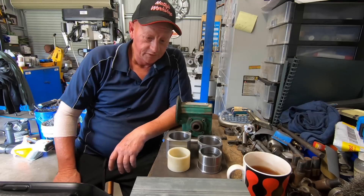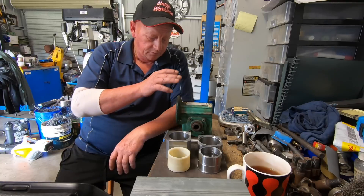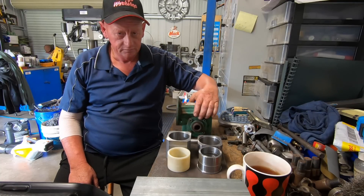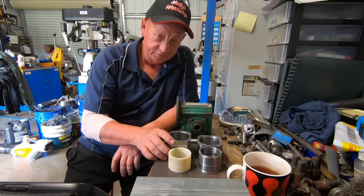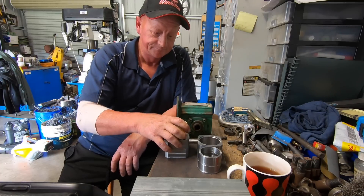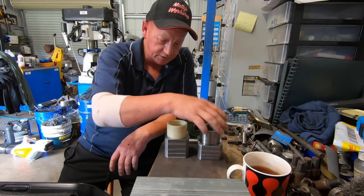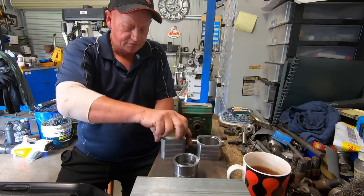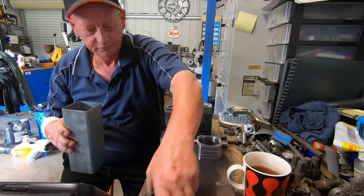The last week or so I've been out here just poking along doing little bits of plain turning work. I was fortunate enough to pick up a right-angle gearbox - I think it's around 40 to 1 - that I can use for the slew, the rotation of the crane. These are the parts I've made so far: that's the bottom bush made out of plastic so it can be replaced. It slips in there, this bush here goes in there and it's got a lip on it so it can actually be removed and replaced.